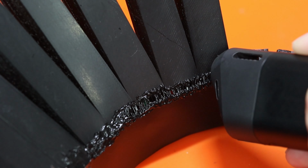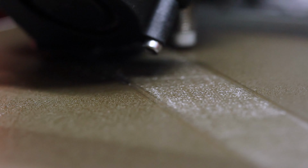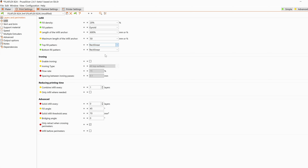The diffusion for the LEDs is created by placing a bit of fire-retardant polyester wadding in the channels before sealing it up with clear 3D printed panels. The clear Recreus filament is actually too clear on its own, so I created an additional diffusion effect by slicing the files to print with an alternating Hilbert curve on all layers. It also looks very cool. Put it all together and you have quite the statement piece.